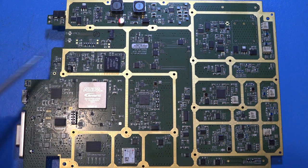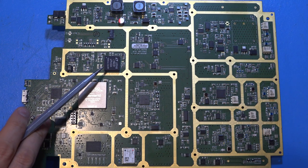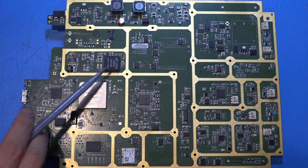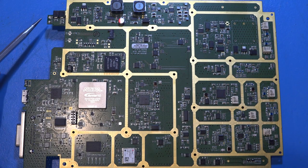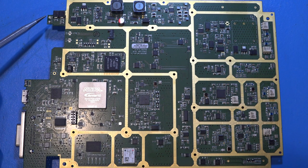There are DC-DC converter sections using Linear µModule regulators — brilliant but expensive — fed from the main 9–16 V power input. The 9–16 V range means you could easily run this from a battery; I'm even thinking of building a LiPo pack to run it off-grid paired with a laptop. There's also flash memory for firmware, a GPS timing controller, and a Cypress chip for the USB interface.